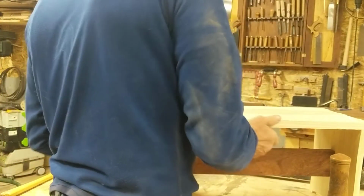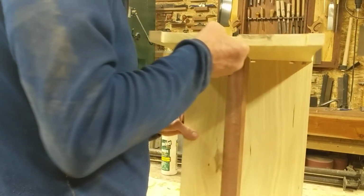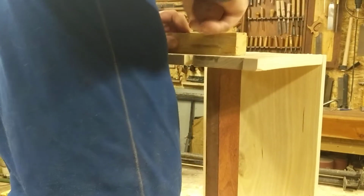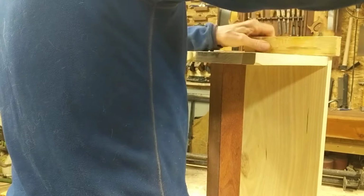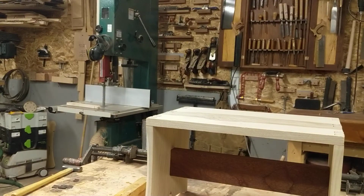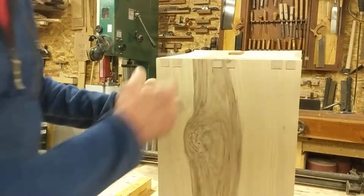This home evenly. Obviously my tenon is sticking out the bottom a little bit, so as I start to hit the rest of this home, I'm going to leave that tenon hanging off the edge of my bench and bring most of this home before I put the clamps on it. So I'm close at this point, not all the way down.